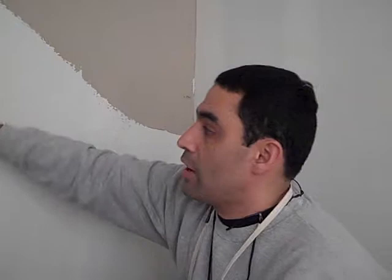Something I didn't mention before: this wall — I don't know if you can see it on the camera — we primed it with the American Clay primer. I also had my own primer which I put marble dust in, and it creates a sandy finish so it's hard. With this, it creates teeth or a grip so as I'm troweling, the clay sticks to the wall — it makes it something for the clay to grab onto.